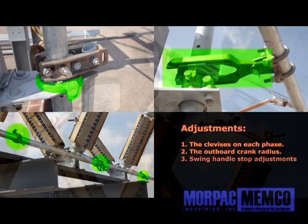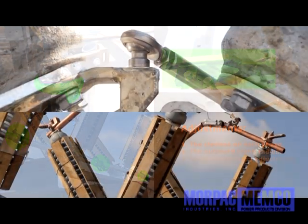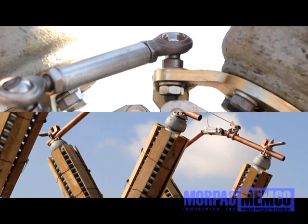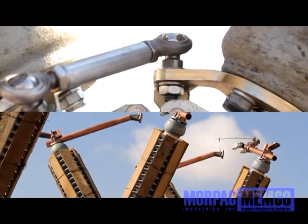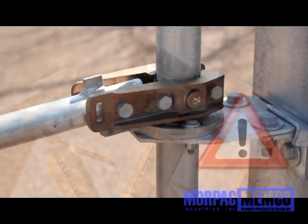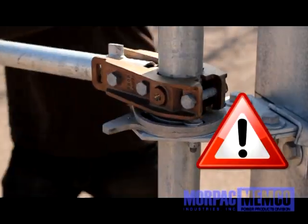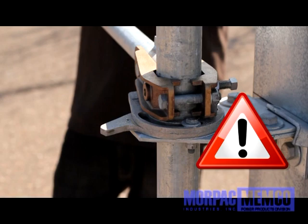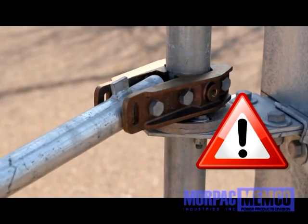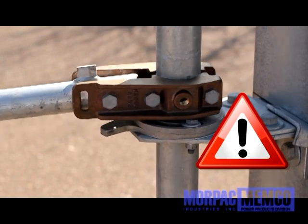It is important to note through this process that visual inspection is extremely important, as one does not want to overstress any component by force. Relying purely on the feeling of resistance at the swing handle is not advised, as this can be, and usually is, very deceiving and may cause damage to various components on the switch or linkages throughout.